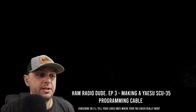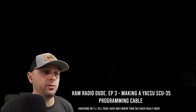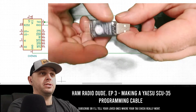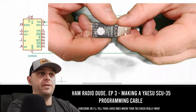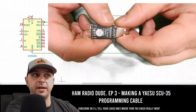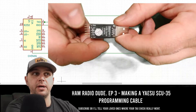Pulling up the schematics, we're going to see a very simple circuit. We're going to go left to right — on the left is the USB device, the CH340G. On the left-hand side you'll see ground on top, then working down: 3 volts, 5 volts, TX, RX, and RST. For this project, all we're going to use is ground, TX, and RX.